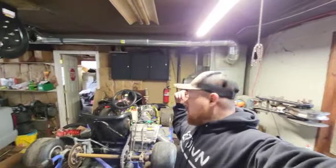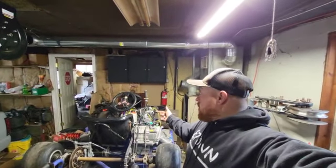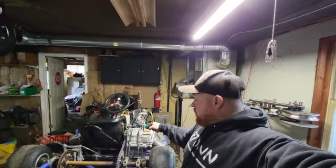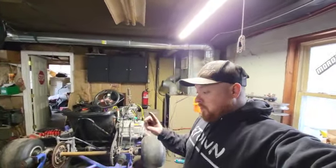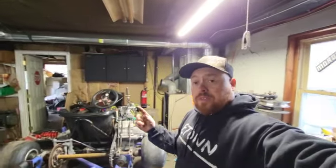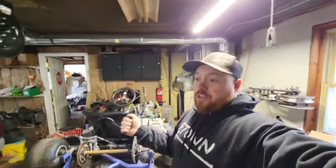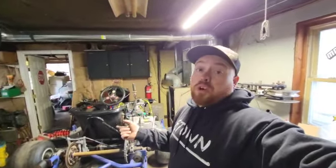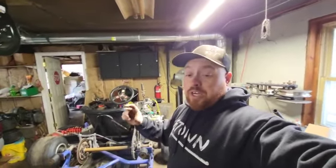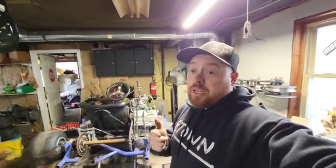What's up, guys? Took her for a test drive. The shifter let go on me. The bolt for the arm fell out, so when I went to shift, it just skipped. I fixed that already. I put a longer bolt in it, and I put a nut and lock washer on it so that doesn't happen again.